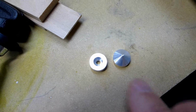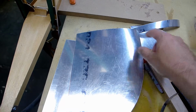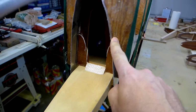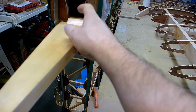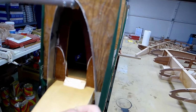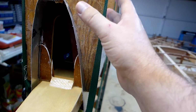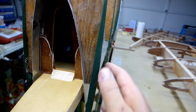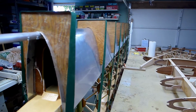So anyway, that's what I'm doing. I'll epoxy these on here. Then I'll drill the holes along here, cut a strip out, drill the holes here and here. Put the dimples in with this guy, and then rivet these on here. Or I may just rivet the strip on initially, then mount the leading edge piece to the wing with epoxy and nails, and then rivet these on along with maybe some filler strips and epoxy along here. So that's where I'm at.